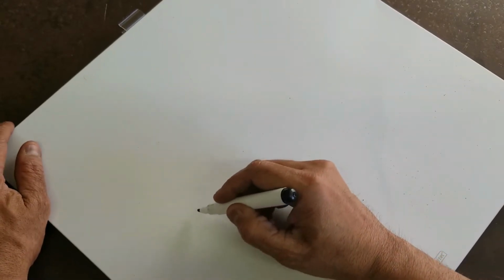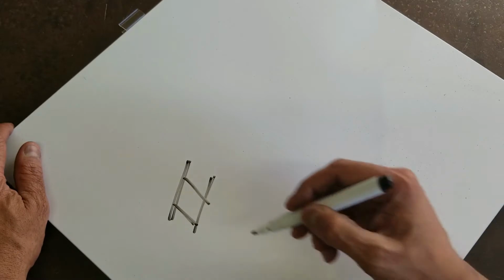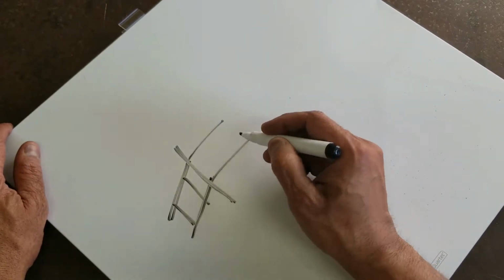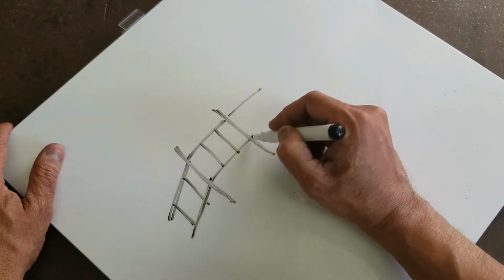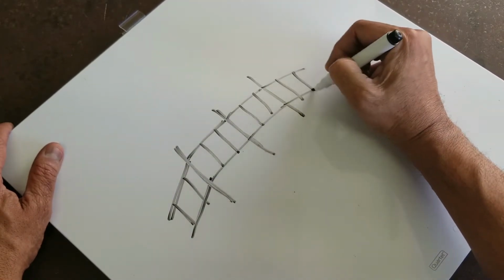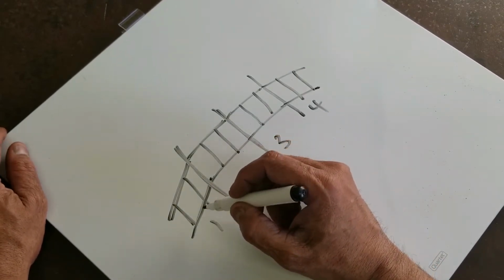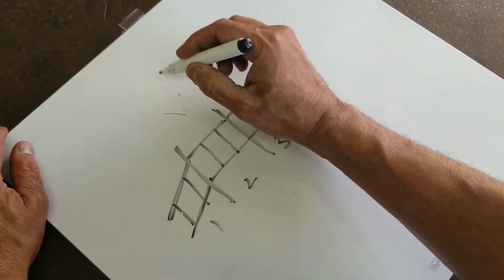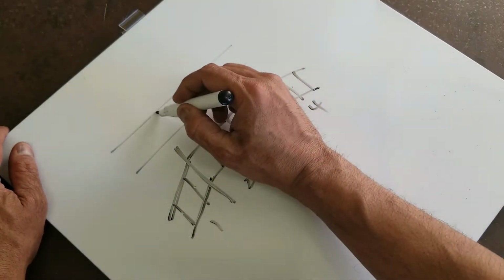Okay, so what it is, is a flat panel. Let's say there are two flat panels in parallel, and I have a few pieces of angled stock that's welded together. And then there's a hinge point here, another pair of flat panel stock with another pair of angled stock, and another hinge point. So nothing fancy really. And the way I'm going to weld the angled stock is like an inverted V shape. So if this was my flat panel, it would get welded like so.